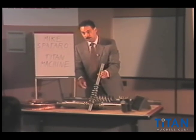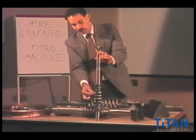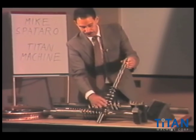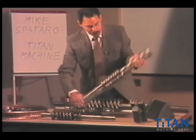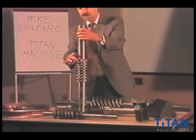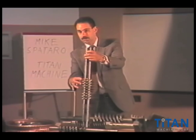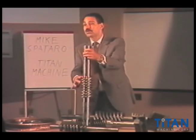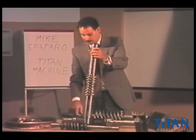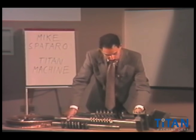This is a sample of a very old-style worm — known as a single-thread worm. On one revolution, it went one thread, a certain amount of movement — that would be a single. This particular one is a double-lead or double-start: you have a start here, and 180 degrees from it is another start. So it actually moved two teeth in one revolution. The faster machines — this might be a 200-foot-per-minute machine, and this a 100-foot-per-minute machine. A 300-foot-per-minute machine would have probably another start, depending on the number of teeth, ratio, and how the manufacturer made it.